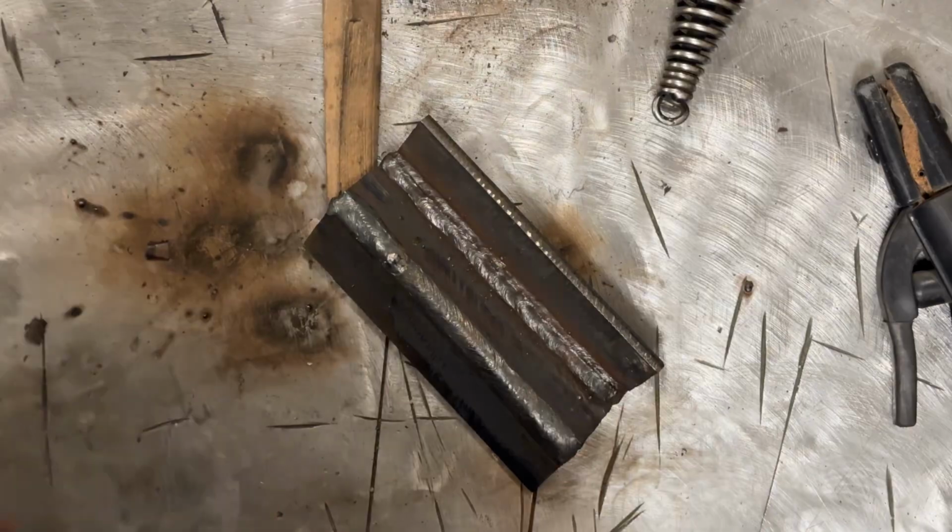Well, I'll get set up for some arc footage now. So the key thing here is to establish your molten puddle, and you can see it's kind of an eye shape, maybe a little bit round and about twice the length that the electrode is wide. You just get it to where it looks like that, and then you slowly move forward and feed rod in to keep it the same size. Literally, that's all there is to it.